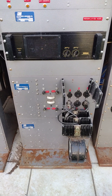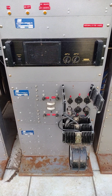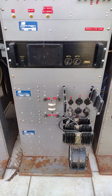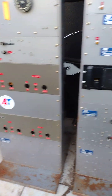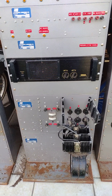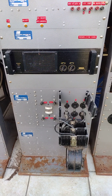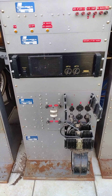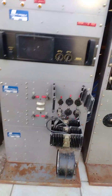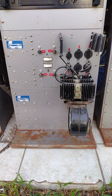The motors themselves that controlled everything were old aviation stuff that ran on 400 Hertz. The cheapest way to do 400 Hertz power back in 1966 was to use audio amps. So when some of the original audio amps blew up, we started using pro audio amps to do the same thing — using audio amps as power supplies to run aviation motors.